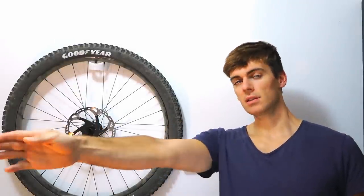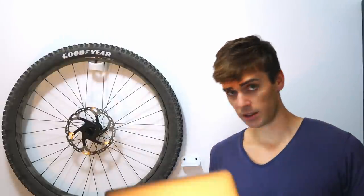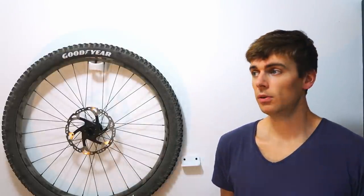Why not have the stanchions retractable, or at least give them an airfoil shape, or morphing fairings that self-set to zero degrees of apparent wind angle? You could bring the coefficient of drag down from 0.5 to 0.05 instead. And these kinds of aerodynamic shrouds could go onto the furling headsails too — say you've got three furled sails at the front of the boat, they could have aerodynamic shrouds that self-set to the apparent wind angle like a weather vane, reducing the cylindrical coefficient of drag from 0.5 down to 0.05.